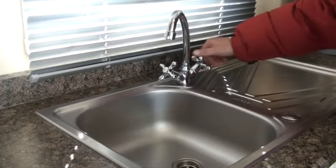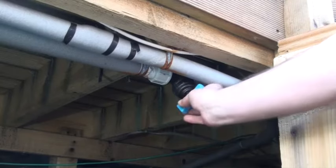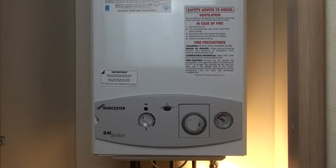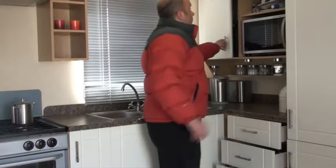One of the great benefits of using Flow is that you can take advantage of little winter getaways down at your property. When we use ours in winter, when we arrive we simply close all the taps, turn on the water and the central heating — it's really that quick, I don't even turn the car off. We go and get some food while it heats up, and by the time we get back it's nice and cozy. Then when it's time to leave we simply drain it down again and leave all the taps open. It's really simple and straightforward.